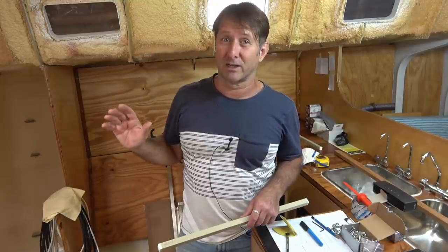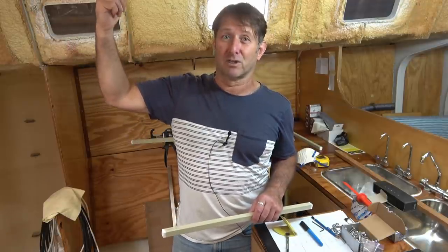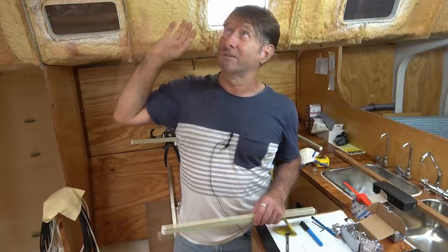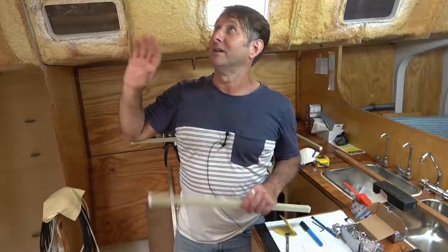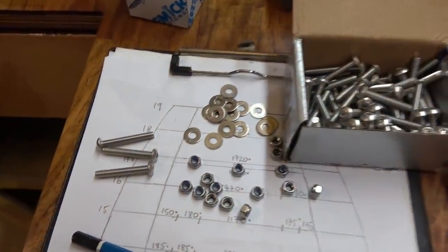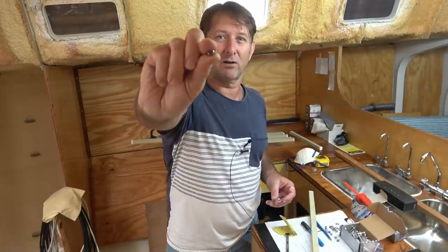The Western Red Cedar weighs almost nothing, so it's really not worthwhile drilling a hole through the steel and then having to wait 48 hours for two coats of the epoxy primer and undercoat. I'll just clamp them. The Fix 15 will do the job. Job done, I say. And also just to point out, the bolts that I'm using, 316 stainless steel, of course, and they're these little button heads, and they're backed up with a Nylock locking nut.